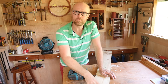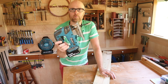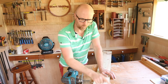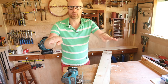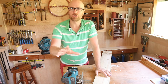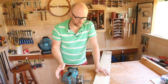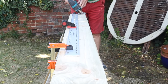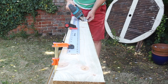Okay, so with the thought in mind that this is no plans, throw yourself into it, one power tool other than a drill project, I need to figure out what angle I'm going to make the roof so that it joins together and it comes down at the right angle. So Mark in the shed hadn't yet realised that the jigsaw that he has in front of him, the Makita, only does a 45. So the right angle turned out to be 45 degrees on each. So when they join together, the two sides of the roof make a 90 degree angle between them.